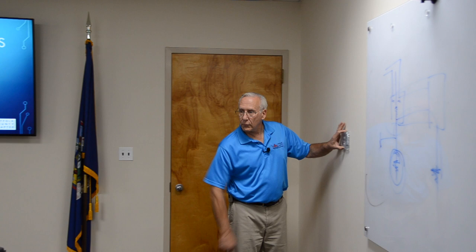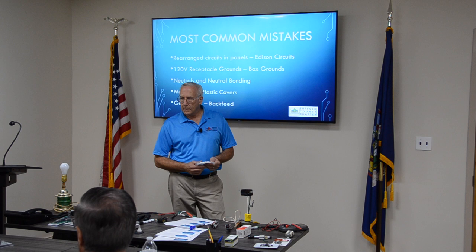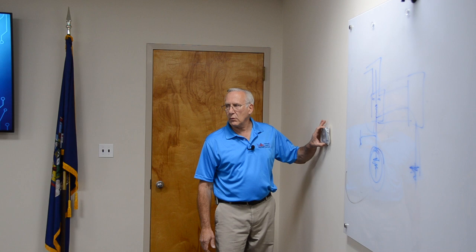Never use a plastic. Metal on metal is fine, because once it becomes energized, it's gone. But it would be traveling through the metal it's attached to, as opposed to you. Yes, the metal will ground it. In other words, if this is attached to a metal box and it becomes energized, it's going to trip the breaker. But if it's tied to a plastic box, I can take a live wire, put it right on a plastic box, it's not going to do anything.